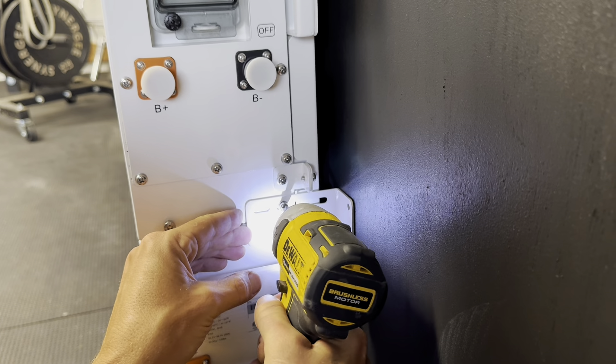Each battery and the controller has a breaker — turn each on, then turn on your breaker in the main panel to test that everything is working properly, at least for this stage of the install. Right there we can see that the inverter has power. For now, let's turn off the breaker in the inverter box until we're ready to tell the system about the Ethos battery configuration. Make sure to subscribe and let me know if you've got any questions.